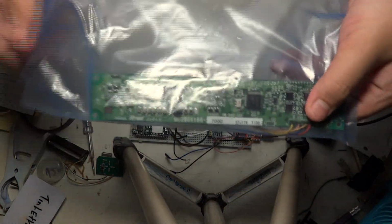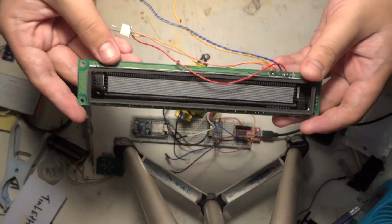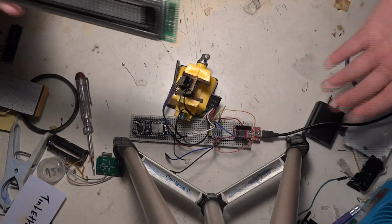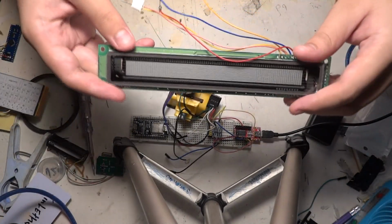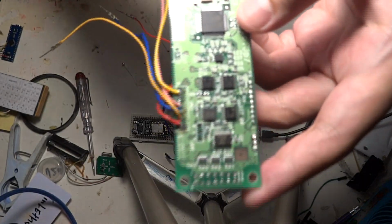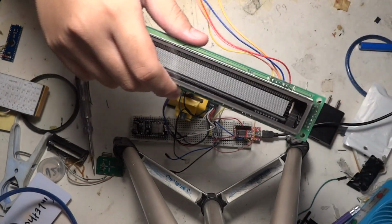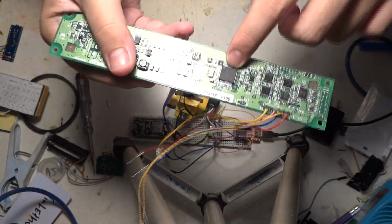It turns out this project failed on this particular display because this microcontroller itself will be the middleman between the host, maybe the CPU or a microcontroller like an Arduino Uno, and the display. So the middleman causes things to slow down. You can take a look here, it's not focusing, but it's okay. Basically things are going to be delayed a lot. I have a plan to fix this, but it's for later because it requires entirely coding bit banging to the display itself, bypassing this little microcontroller here.